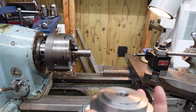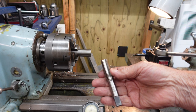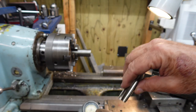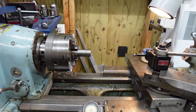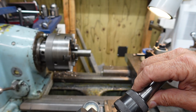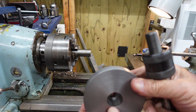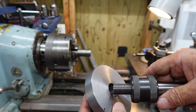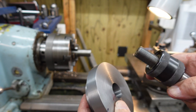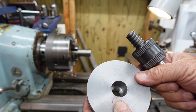It's noisy here at the lathe, but when I threaded this with a three-quarter 16 tap, it won't go in too tight. So I made a second mistake — I put the counter bore too deep, so this would end up hitting. I had to solve two problems: the counter bore too deep, and secondly, the threads.